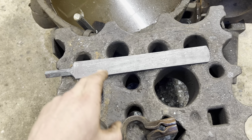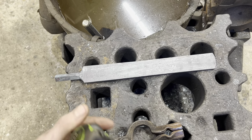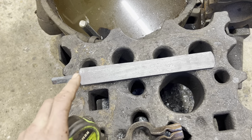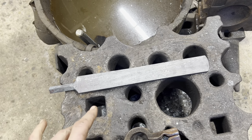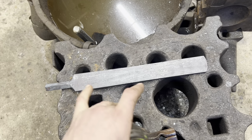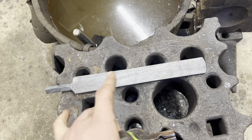We may or may not end up having to do some forging on the bevels to make it a little wider. I'm hoping not, because the biggest challenge that I've run into with Sanmai is keeping the core centered, and I really have yet to produce one that I'm 100% happy with. So I did my best to work from both sides and keep everything even. I'm going stock removal from here instead of forging out the point and forging the bevels and the ricasso and the tang and all that, which is going to kind of help us keep that core centered. I hope. We'll see how it goes.